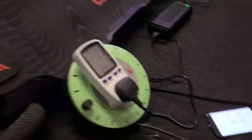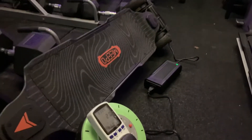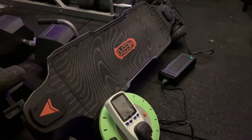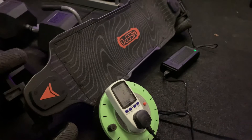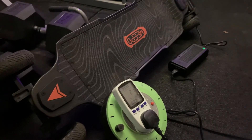At just under three hours, it's not too far off my back-of-napkin math. The capacity of the battery is supposed to be 726 watt-hours, and we were charging at an average of about 280 watts. Running that math gives me about 2.6 hours.